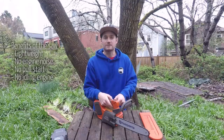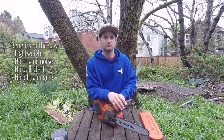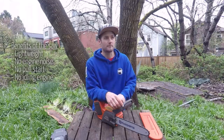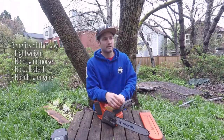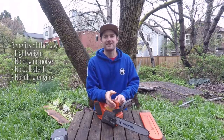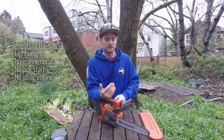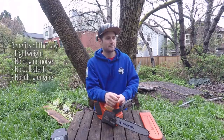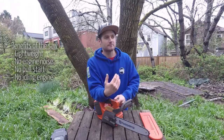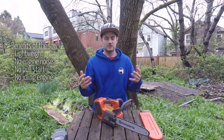There's no pull start on this, and a lot of people might not even think of that as a benefit, but as soon as you start using the saw you realize it. If you're doing a removal and you're conscious about not leaving the saw idling, you may be pull-starting the saw something like 200 times. Doing that motion a couple of hundred times a day — you don't think about it until you've used one of these saws, but it's actually irritating and causes repetitive strain.